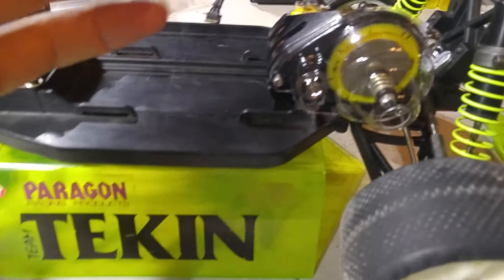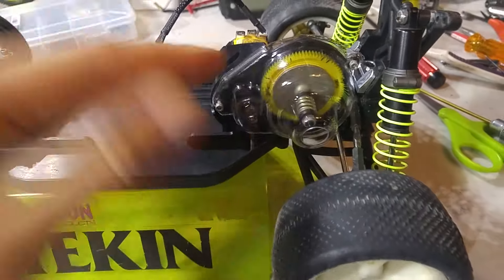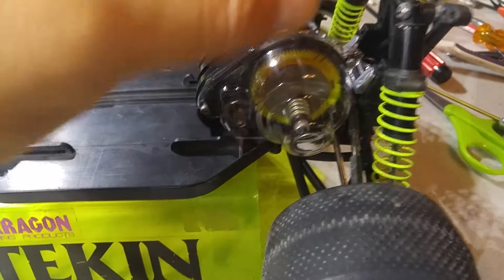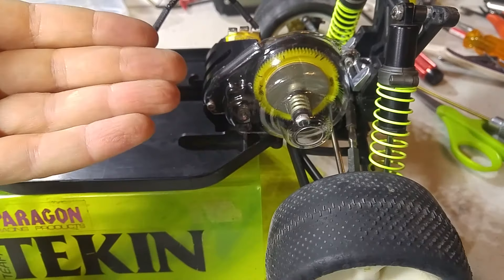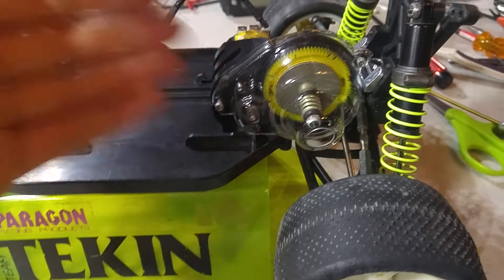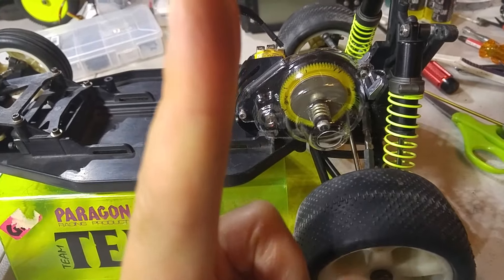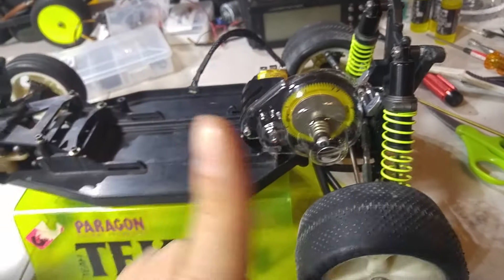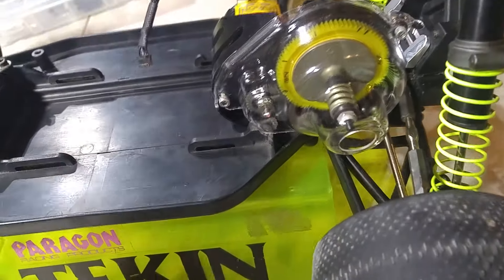First, I did have to cut a little bit more of the motor plate that wraps around on the underside because of the way that the pivot block is set up. There is material around certain portions that the motor mount will run up against. So I just had to cut away a bit more material there so that when the motor mount comes around, the two screw holes that go through the motor mount line up with the screw holes that go into the gearbox. When you mount the mounting screw from underneath, it has to go through all those holes and they have to align.